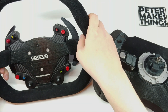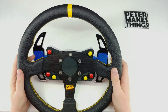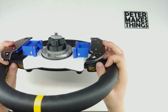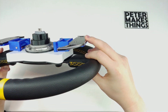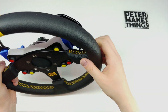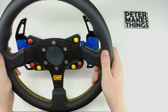Personally I just prefer the springs, and that's why I made this: a 3D printed shifter with two small springs inside and an aluminium pad. Here are the shifters on my wheel — let me know in the comments what you think, but for me they look pretty awesome. The travel of the shifter is designed to be 10 millimeters and the distance from the rim can be adjusted to match user preferences. The only real downside is that they don't make a very strong click.